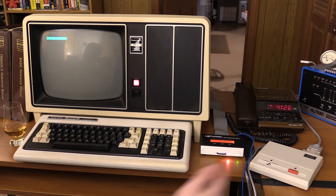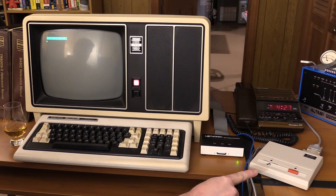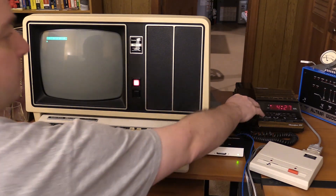The DCM6 is not an intelligent modem by any stretch of the imagination, so I need to dial for it. To dial, I'm going to use this slightly newer but still relatively vintage Realistic Chronophone 255. I'm going to dial over to the other modem, which is going to pick up. And when it does, I will connect this modem and hang up the phone. So here we go.